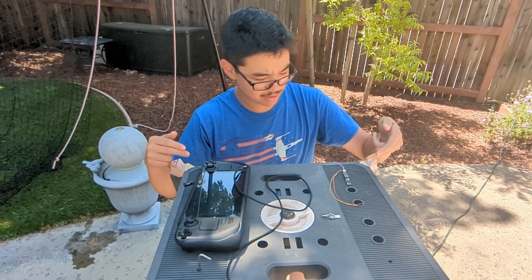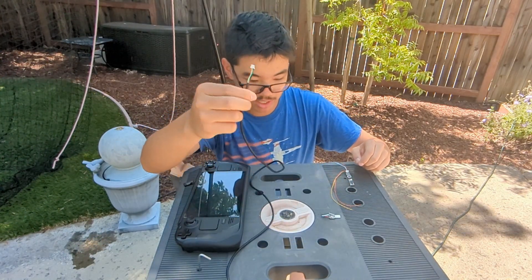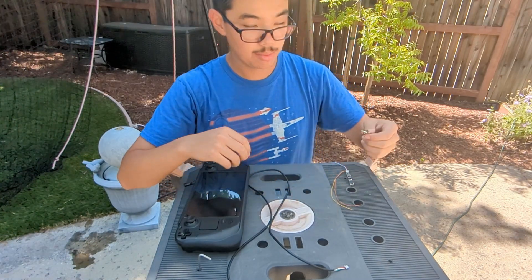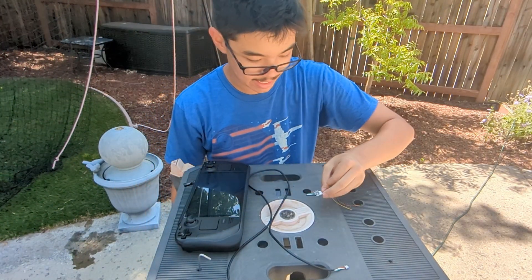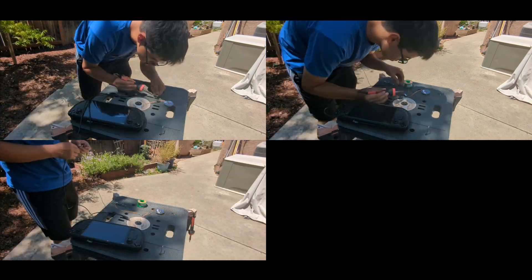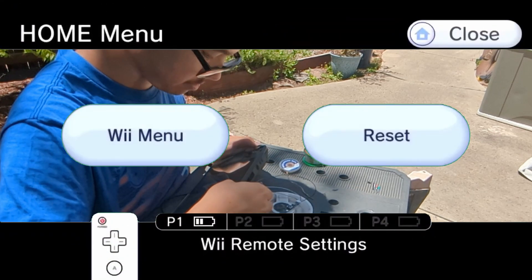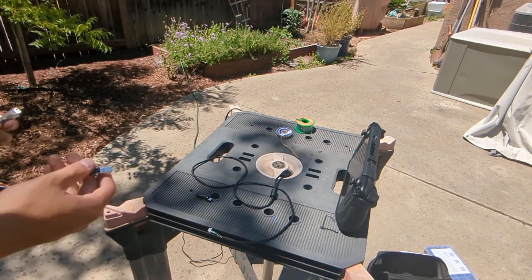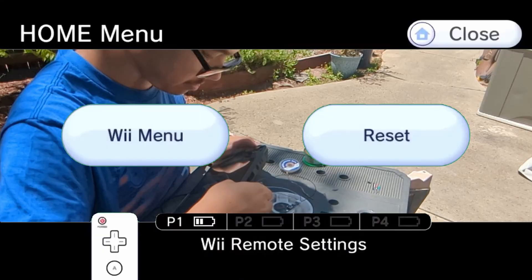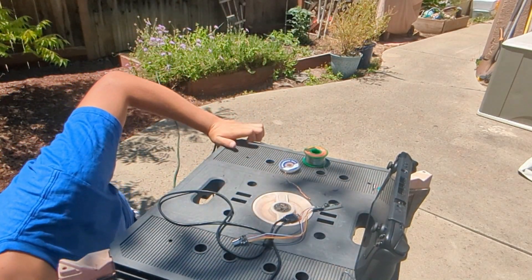It is time to solder up our camera. I've already roughly parted the wires and will attach them to the USB-C connector. After soldering, I tested it — and it wasn't working. Turns out I just got the data positive and negative lines backwards, which is fine, we just swap them. And once I did that, it worked. But you have to remember, this is the voice of a man who just spent literal days troubleshooting the Framework camera. It was not a fun experience.